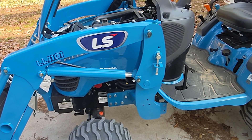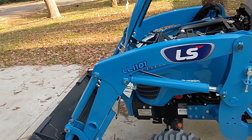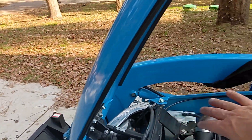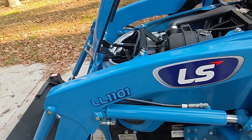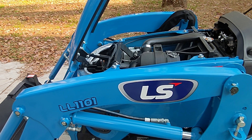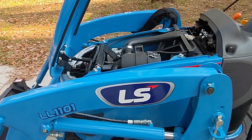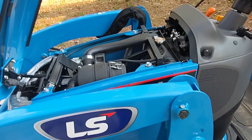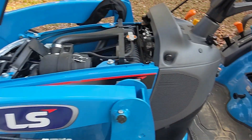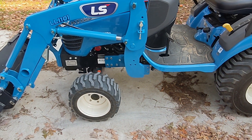I believe Kubota also has this arrangement. John Deere does not — the engine is flipped 180 degrees and goes front to back. Bobcat has a front-to-back as well. I think TYM or maybe Branson has it in this configuration too. So that may be something you're interested in if you plan to do a lot of work in the summertime at an open station, since getting hit with hot air might not be your thing.